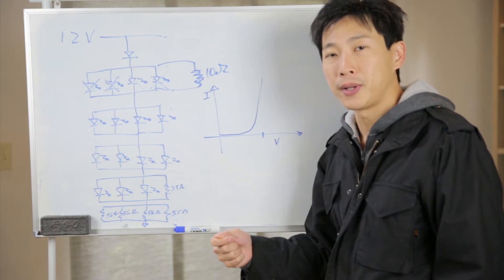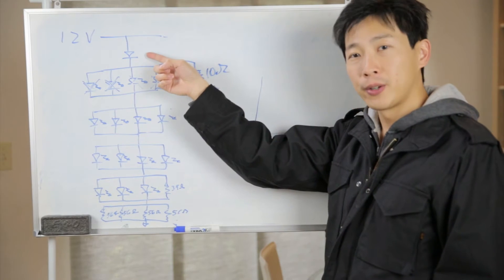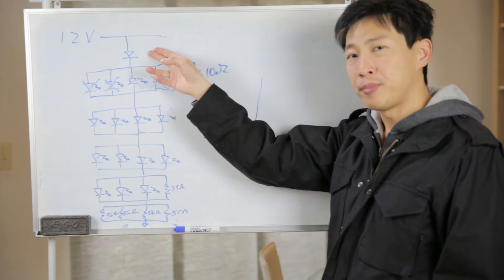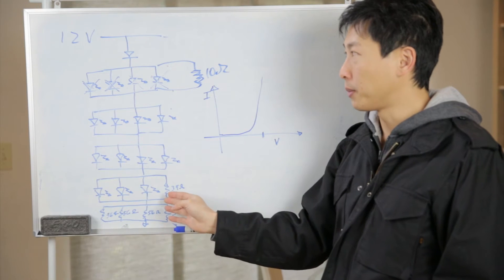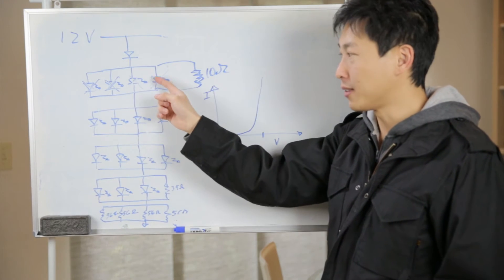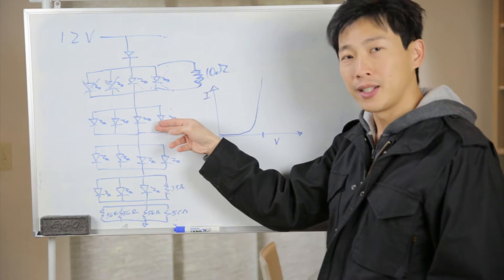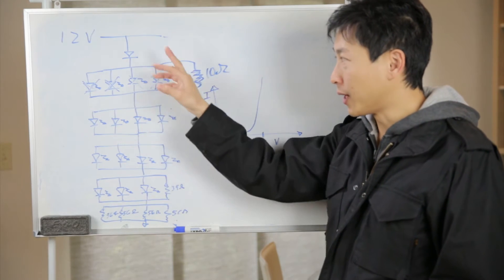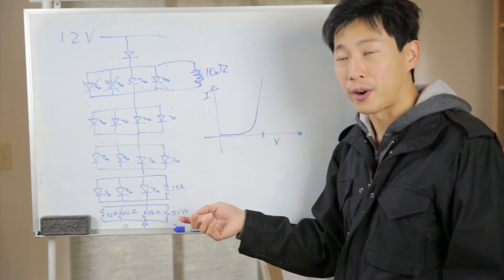Let me cover diodes briefly because it will help you understand what's going on. There's a diode here that's not the LED kind — it doesn't emit light. It may have been put in so that when you reverse the voltage it won't cause problems in case the LEDs are broken short. If these LEDs are shorted and you reverse the whole thing, you might get overcurrent and blow some fuses in your car.